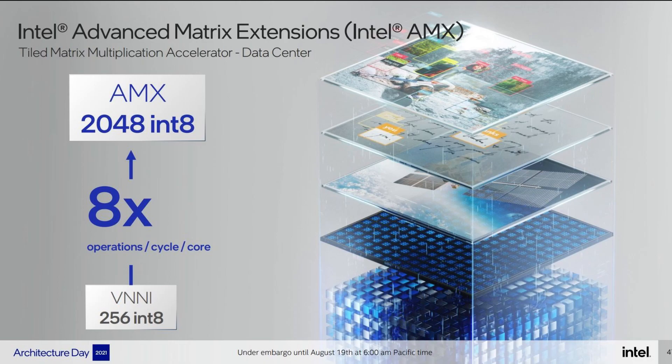For customers in the right upgrade cycle — perhaps coming from Skylake or Haswell/Broadwell platforms — you should expect anywhere between a 35 to 50% increase on standard workflows just from IPC. And if you're using features like AVX-512, those might get a bump as well. Intel is also introducing AMX — Advanced Matrix Extensions — for Sapphire Rapids. Kind of like Tensor cores, but not exactly. There's also a new accelerator interface architecture to help address specific customer workloads.